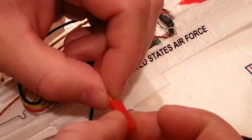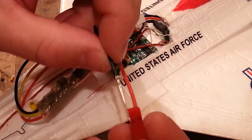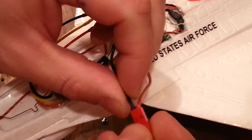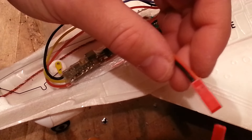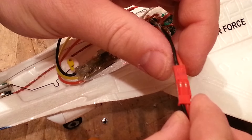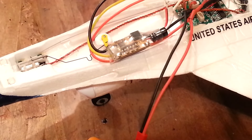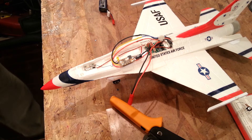You see how there's a little slot at the top of this little JST connector? That slot is going to be where that tab needs to go. I'm going to slide the positive into terminal number two — it clicks and holds tight. Then I'm going to take this, put the tab down, and put this into the negative side. I'll tug on it and it feels great. Line it up — there's our key — and they do line up. So you could plug it in at this point and it's turning on.